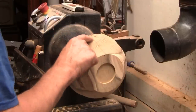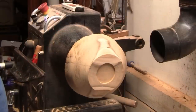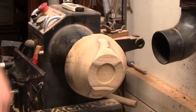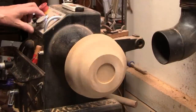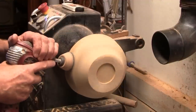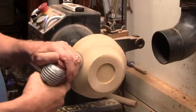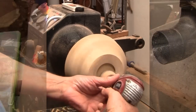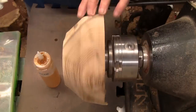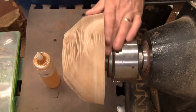This is ready to sand and it's fairly smooth. I'm going to start with 100 grit. That crack filled real nice with the CA, so I'm happy with that. I'm going to be sanding with the lathe in reverse at around 400 RPM. I'll start up my dust collector and we should see a lot of dust going over there. I've got it sanded at 400 and I think it looks great — the grain in here is really cool.